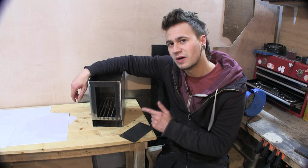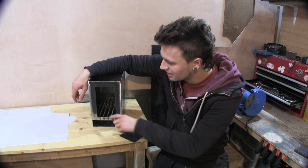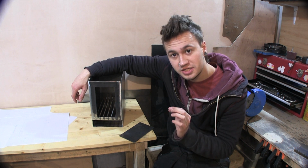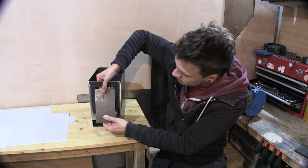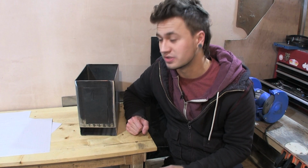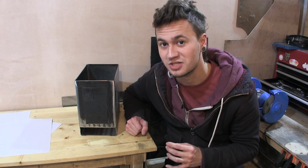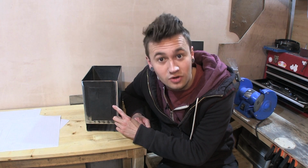So we've got the stove welded up and looking nice and three-dimensional. We've got the round bar fitted inside, and also I've rounded off the edges. Now at this stage, we're ready to start fabricating the door. I've made this little insert, which is gonna go inside like so. And the second part of the door is gonna overlap the frame. This is to help increase smoke retention. After that, we can think about making some hinges and the locky, shutty door mechanism.